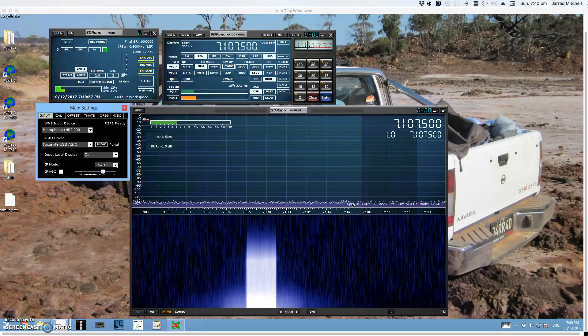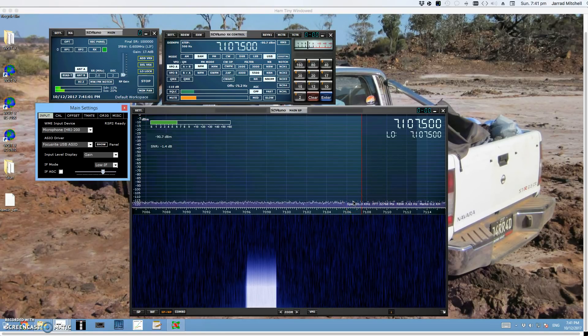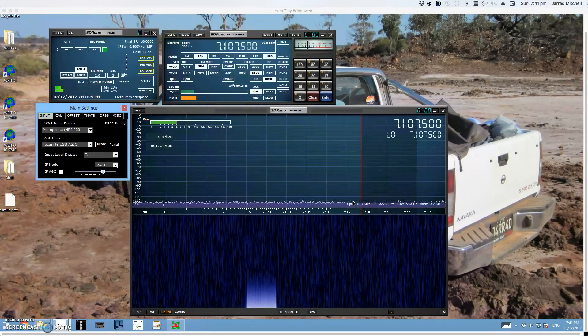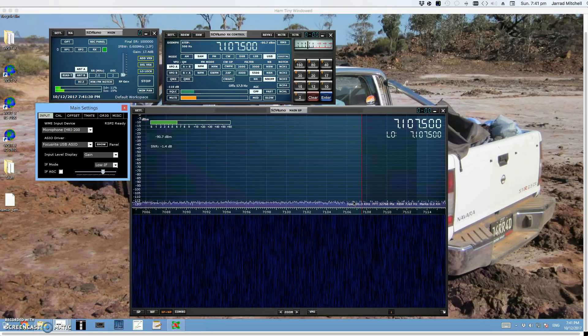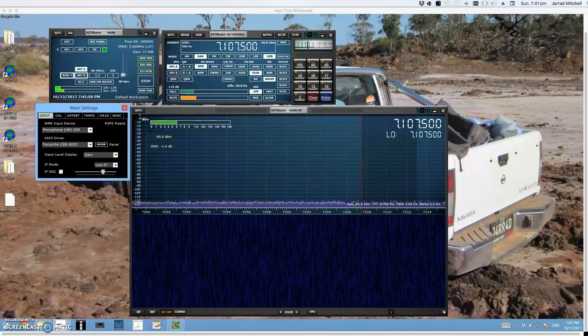Some people would argue these are more engineering-grade tests, and I'm completely happy because I did them using pre-generated audio files played through the SD card using the voice keyer. The radio's internal digital-to-analog converter — done at the RF stage rather than AF stage, as a modern radio — takes care of decoding the WAV file. That's better than using the USB interface, where you'd have to worry about the cleanliness of the USB stage and any subsequent DACs. I'll make those audio files available — the tones are from memories 700 and 1900 Hz.